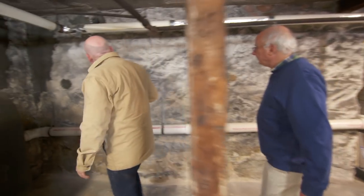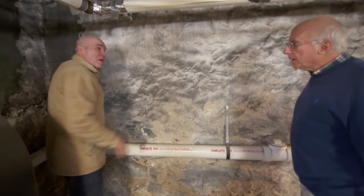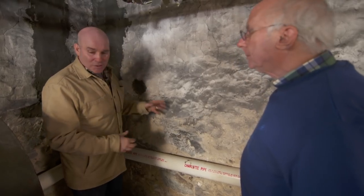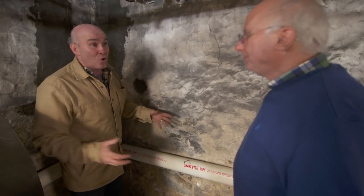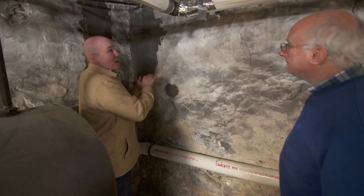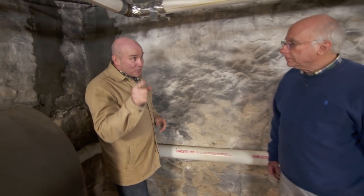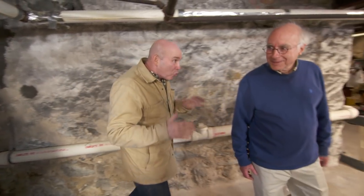The foundation — this is one of the old stone foundations, and under this stucco coat are individual stones that they probably took right out of this hole and stacked up as the foundation. I see a lot of cracking here, which may indicate that some of the stones on the corner walked away, which would be responsible for the settling. But everything, in a general sense, looks pretty good. I bet you when we fix this fireplace, you're not going to have any more problem with the settlement.